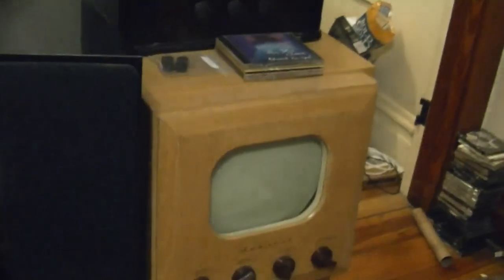Alright, now, the most striking thing on this, of course, is the cabinet. Sort of this limed oak, or whatever you want to call it, blonde finish. Very similar to what's on that Admiral over there. I imagine it's a red oak substrate, then various layers built up to give it this nice creamy finish. Fortunately, a little bit of damage here and there, like right here, and some good old latex paint I'll have to very carefully get off. This is a kind of veneer, faux finish kind of thing. This I think might actually be some kind of hardwood with just a thin translucent whitewash on it. So I'm not as concerned about getting the paint off of this. And curiously, there's only paint splattered on this. None got onto this. So it might not be too bad to touch up.